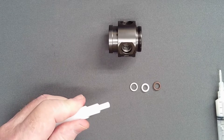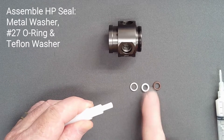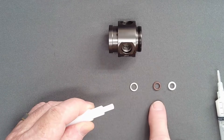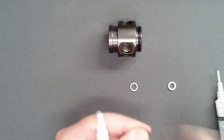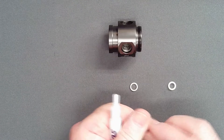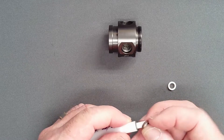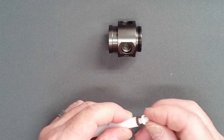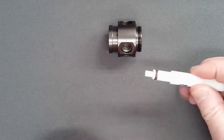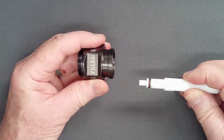Create a stack of parts on the piston bushing tool with the most superficial part first and the deepest part last: the steel washer first, then a generously lubricated high pressure O-ring, and finally the Teflon washer. While the manual recommends other steps before inserting the stack, consider inserting the seal assembly now so that it does not pick up lint or other debris from the work area while awaiting insertion.